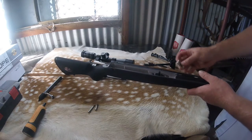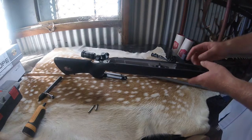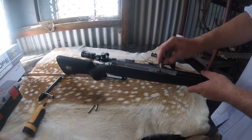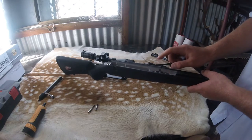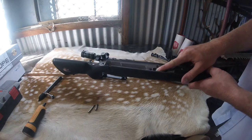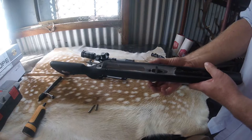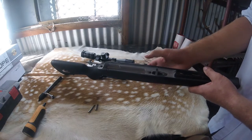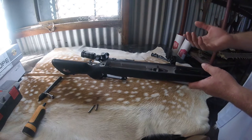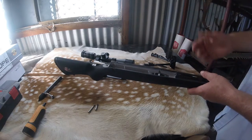We do an oversize recoil lug because there is a lot of variation — guys want to use larger ones. It's a 6mm slot but slightly wider than standard, so the Lumley titanium ones fit in nicely, but they will move from side to side. Once it's torqued down and bites, it will not move — so don't stress about that. The pillars are already in but they aren't glued — they're just a push fit, nice and tight. If you want to bed it in, you can drill that out, put it in loosely, rough out the outside, and go from there.